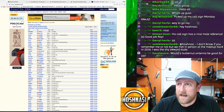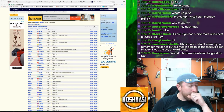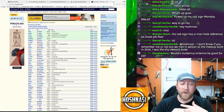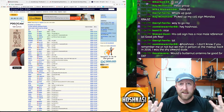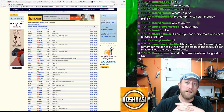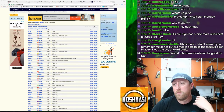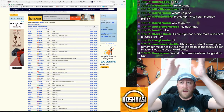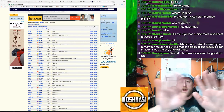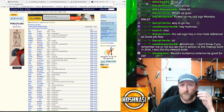So, I Love Lasers asks, would a Butternut antenna be good for DX? So, here's the general comment about DX. Any antenna you have on the air is going to be better than no antenna. And if you're deciding to buy an antenna and the Butternut is the one you're thinking about, then yeah, it would be good for DX, because right now you've got nothing. If you're talking about the best DX antenna, you're mainly going to be looking at horizontal polarization beam antennas. Those are the ones you see when you're driving down the freeway, the big towers that may have a rotator. They have a long arm with one driven element and then lots of pairs of legs, like a modified TV antenna, but they're flat, not arrow-shaped. Those are beam antennas, or Yagis.